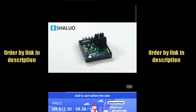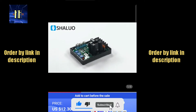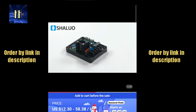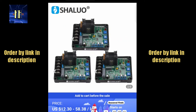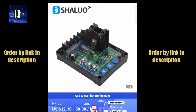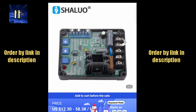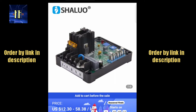Universal Brushless Generator Automatic Voltage Regulator, AVR8A — Universal 8 Amp, Half-Wave, Self-Excited, DIP Switch Programmable AVR. Voltage regulation less than plus or minus 1%, 200 to 240VAC programmable input, rugged compact design, soft start, voltage ramping with under-frequency roll-off protection, and EMI suppression.